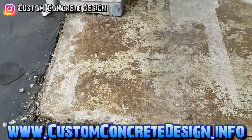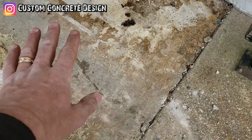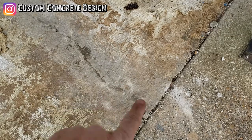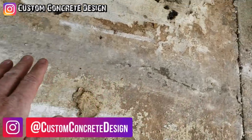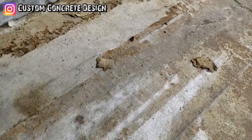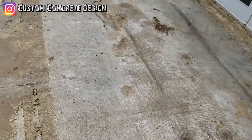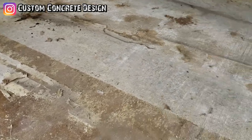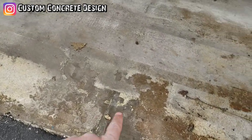There's a lot of holes around the perimeter. I can see a crack already right here — it's already there and it's going to start forming more as I grind the surface. That will develop wider and longer; right now it's filled in with dirt and glue from over the years. I would imagine that's going to be a pretty decent-sized crack that will have to be repaired. Most likely there are more cracks in this — usually there are with concrete this old. I'm guessing it's a good 20 or 25 years because they've covered it up like four or five times. There's a cold joint right here that I'll have to ream out and repair, and then another one right here as well.